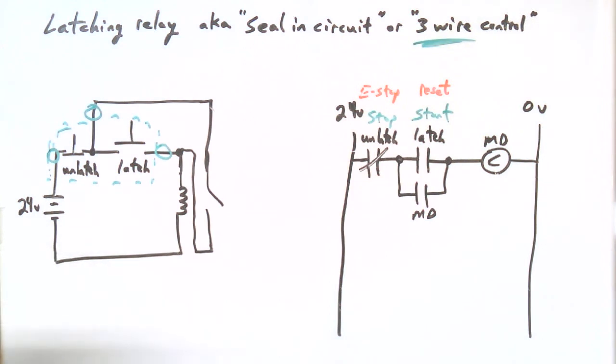So just as we wrap up the video, we could maybe review the mindsets. You always want to ask yourself, what are your indicators indicating in a very precise way? We look at exactly what they're indicating. It's nice to have positive indication so that you don't get fooled by a wire just coming off or something. Redundancy is nice. It also helps not get fooled. As long as everything's agreeing, you have a reasonable certainty. And then redundancy for other reasons too. Maybe it will just prevent failure if you have redundancy. And speaking of failure, you would prefer things to fail in a safe manner. So look for those failures and look for how it's going to fail in a safe way. So, okay.